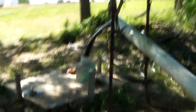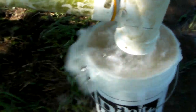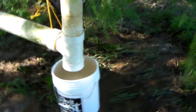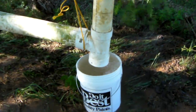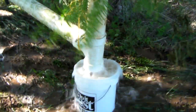So that is the new airlift pump design — it's a tandem airlift pump. The reason why we went this way instead of one big two inch is because the static level is so far down on this well. It's a 131-foot well and the water's — that pump's only sitting in 40 foot of water, so it's having to lift it over 100 feet pretty much, once it has a drawdown on the formation.